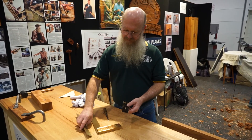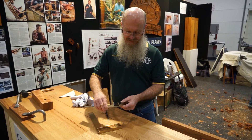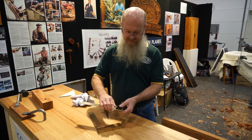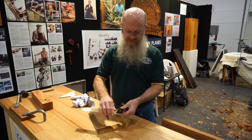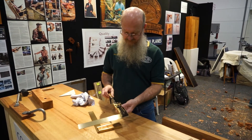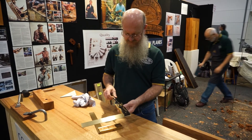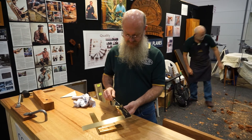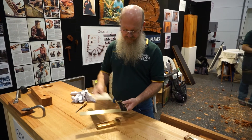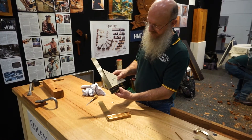To put the square together and set it to square, I just place it in and by moving it around a little bit, lightly pushing on the pin, you'll soon see where it just falls in. Pull it into the rebate — that stops the pin moving up and down as well. Now I'd just tighten the screws lightly to just feel some weight on them, and looking roughly, it looks reasonably close to square.